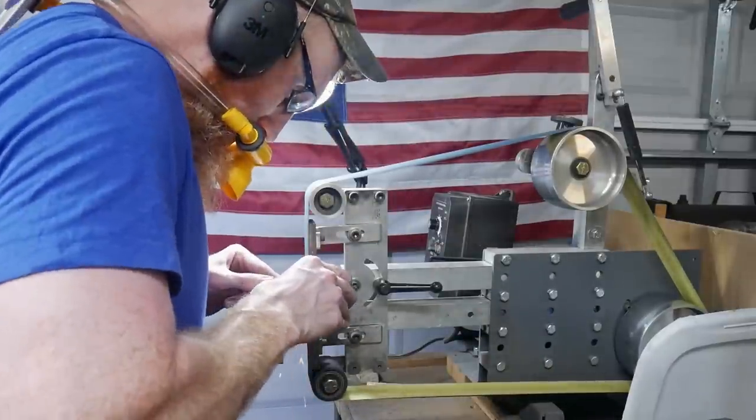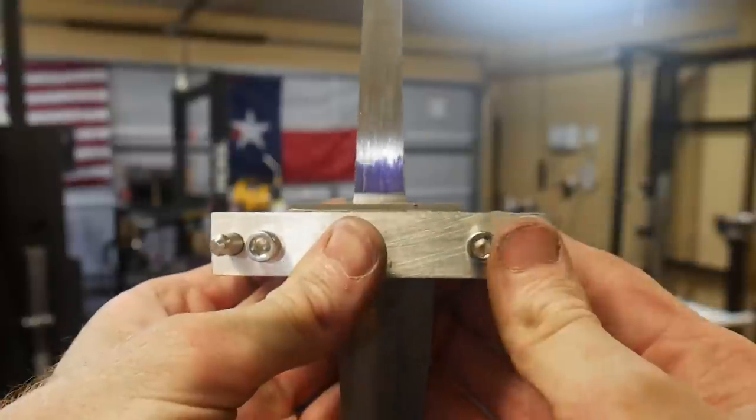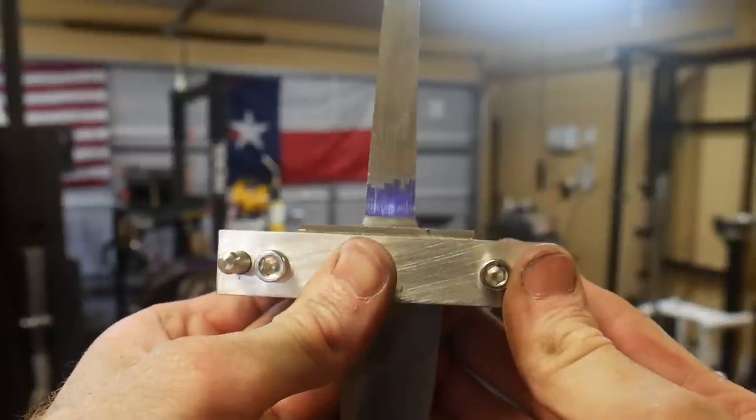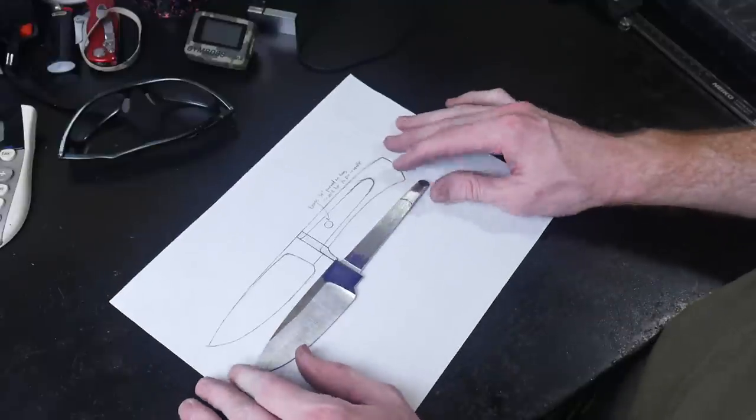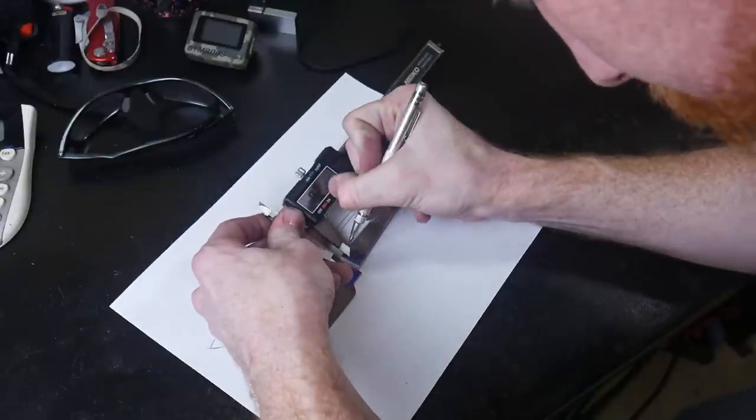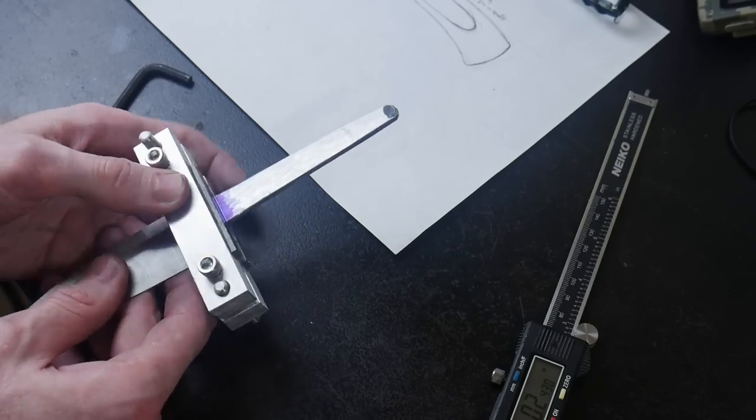What you can see me doing here is filing away a little bit of the sides of the tang so that the guard will be able to fit over the ricasso on the sides and you'll never see any daylight. I've seen this done both ways — where the sides of the tang are not taken in during this step — and I think Carl Anderson would be a good example of someone who's had a lot of success without doing that step.